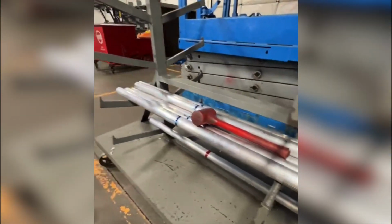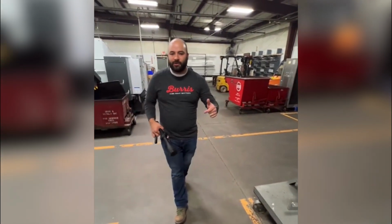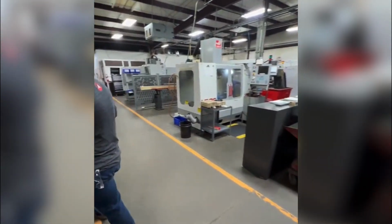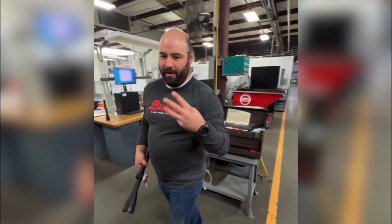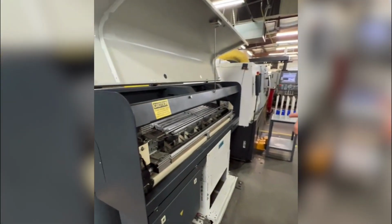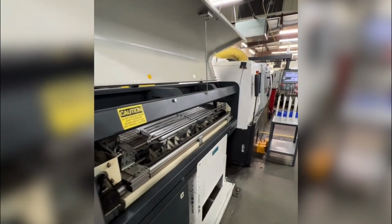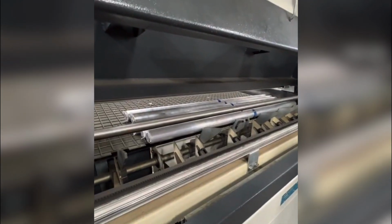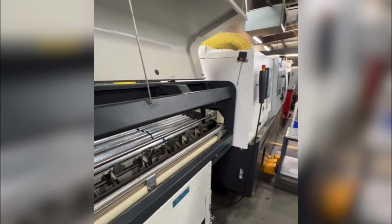This is the rough material that we're taking a look at here in this rack. We're getting raw aluminum extrusions in. We feed them into this bar feeder right here. It goes into our lathe, and we run 3 operations on this raw material to get a finished outer tube. So right here we're looking at op 10 and op 20. This is where we're doing a lot of our turning operations. So all the circular features are all made complete here on these machines, including threads.